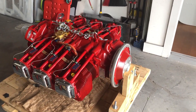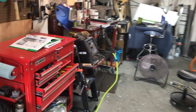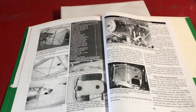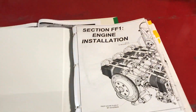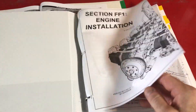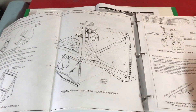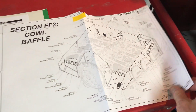Some of the things I had to think about when I got the engine: where's everything going to go? There's not a lot of resources for that until Mike Silvernail told me about the RV-10 firewall forward kit. This is all I have from Bearhawk on installing the engine — there's a little discussion on it — but Van's supplies an RV-10 firewall forward kit, and these are the plans that go with it. This is fantastic stuff — detailed plans starting with the cowling and baffling, giving all the details for each piece.